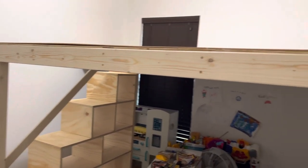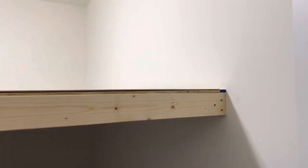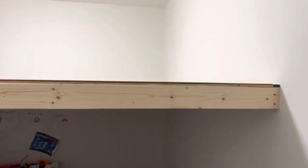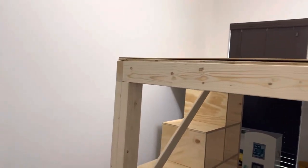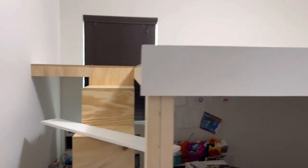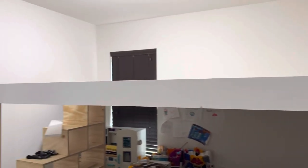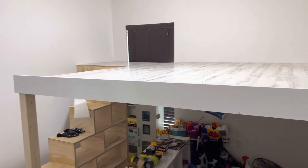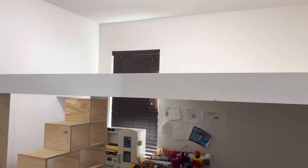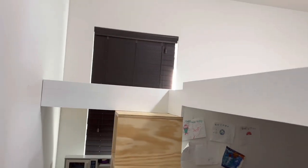Where the main frame meets the floor, I didn't like how it looked, so I bought a 1x6 board to cover the entire 2x4 and the flooring edge all the way around the main frame. It looks beautiful — and the extra almost two-inch raised edge also gives me room to put in the siding later. To cover the entire side I only needed one piece of 12-foot 1x6, the most affordable kind, painted white.